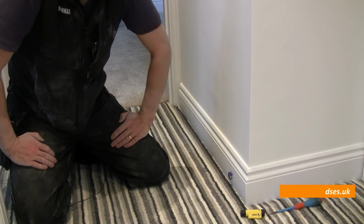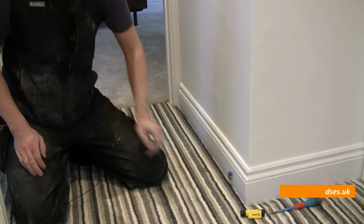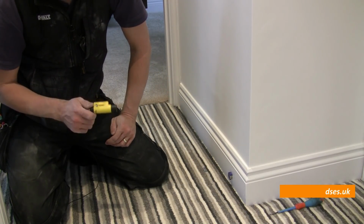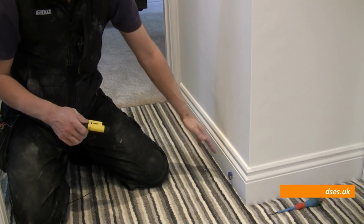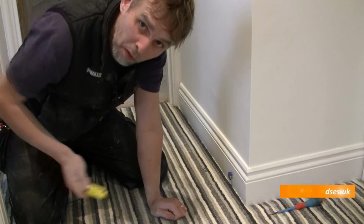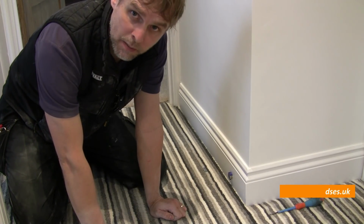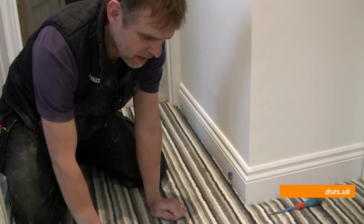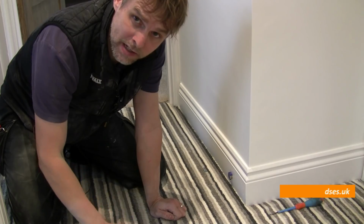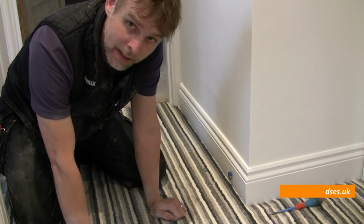Some of the cable is visible from below because we have downlights in the hall immediately below me here. So what we're going to do now is use the ferret camera to visually verify as much of that cable as possible, because it might not be this. That's my smoking gun for the moment, but it might be that the plumber or whoever, when he's run his pipes after we've put our cables in, has perhaps caught the cable and done some damage to it. But there are a couple of places where that cable is going to be visible below me if I take the downlights out, and I'm going to use this to visually verify what I can see of it.